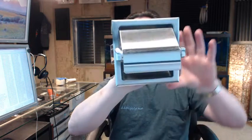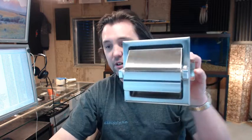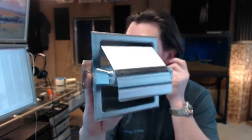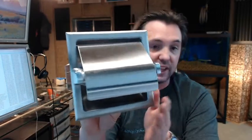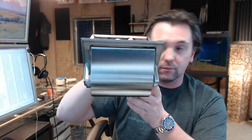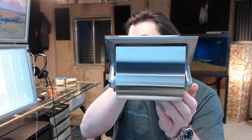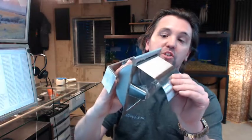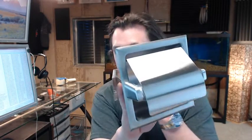Okay, so moving forward, back to the product specification, you'll see it notated that this is type 818. This is 818 stainless type 304 and a satin finish, a number 4 finish. That's typical material. Okay, stainless steel. 22 gauge thickness. The hood is 18 gauge. It's noticeably thicker than the rest of the material.